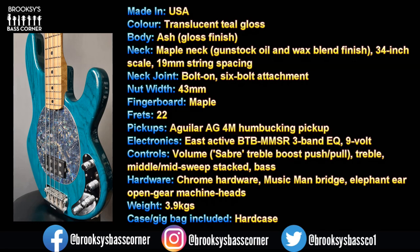The mid EQ is simpler with a center detent and 12 dB of boost and cut, and a frequency sweep from 100 Hz to 1 kHz or 200 Hz to 2 kHz, depending on the jumper settings on the circuit board. This bass has it set to the lower setting.